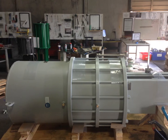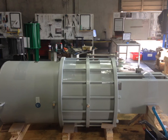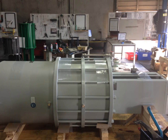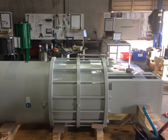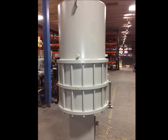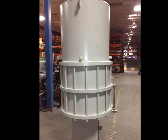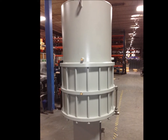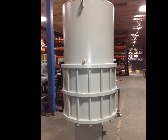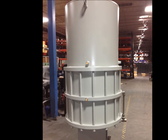All of our products include options for corrosion resistant materials. This particular application features a stainless steel piston rod. The actuator is coated with 3 to 6 mils of epoxy primer. While ATI offers a wide variety of corrosion resistant coatings, this particular order will be top coated at the customer facility to their own internal paint spec. The end user is a petrochemical complex in Rio de Janeiro, Brazil. Thank you for watching this edition of Automation Technology Design Showcase.